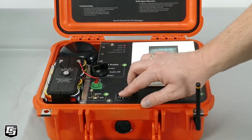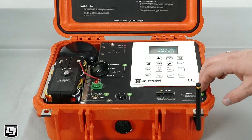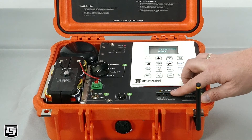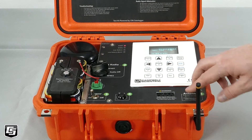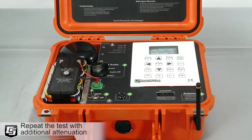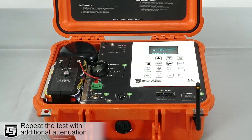Now a test is ready to begin. We can hit test. The test radio box is powering up the radio and going to initiate communications, and a pass-fail will be displayed on the results screen. An attenuator can be used to introduce radio loss into the communication link. This is a 40 decibel attenuator with four steps of 10 decibels each. A good radio link should have at least 10 decibels of radio fade margin. It is good to test various antennas with attenuation to figure out the best combination between your two sides.